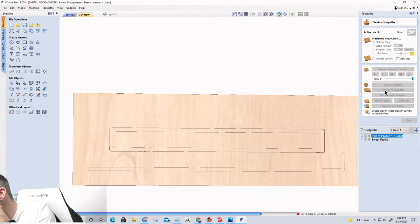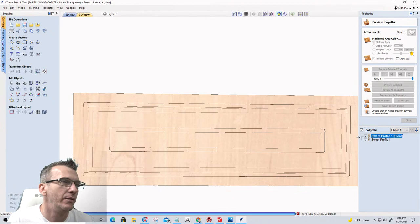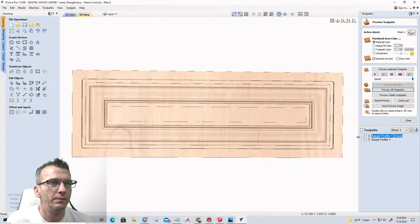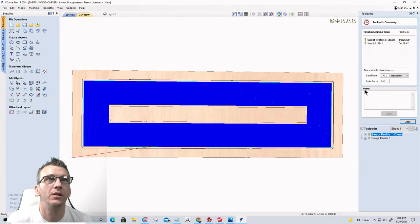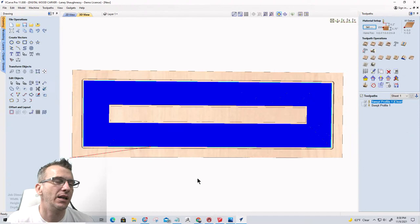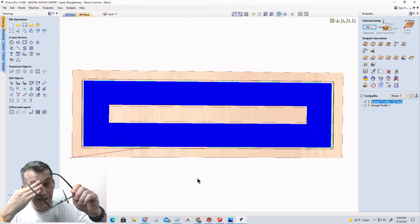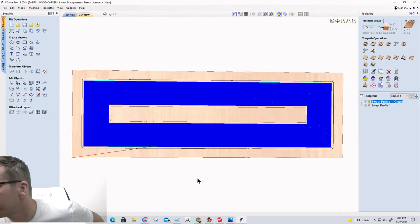So now, yeah, Robert, as far as time wise, we'll look at the carving time on this. Now, this is based off of my machine, my tool settings and everything. But this is just a gross estimation: the rough cut is going to be about 25 minutes, and then the finish cut with that 16th inch tapered ball nose doing all that detail work, about 6.5 hours. So times 8. Eight times six is 48, right? Oh God, I can't think tonight, guys. So, two-day job to get all the drawers done and everything.